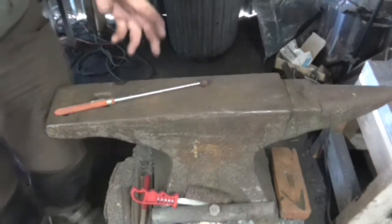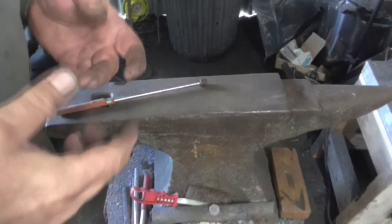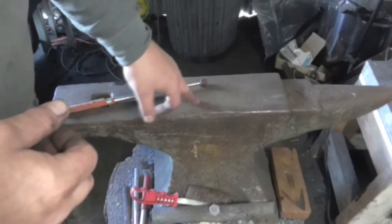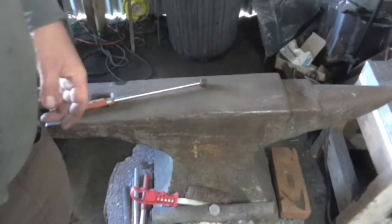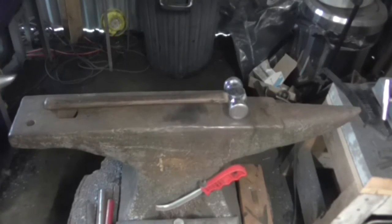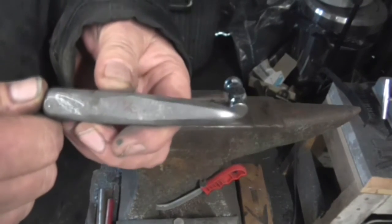The reason we bury it in the ash in the fire is if you air-cool it, one side will cool more than another if it's on a surface. Particularly on the anvil, that will draw heat out of one side and it will bend — you'll end up with a banana. No good. Okay, attempt number two. Attempting this centre punch.